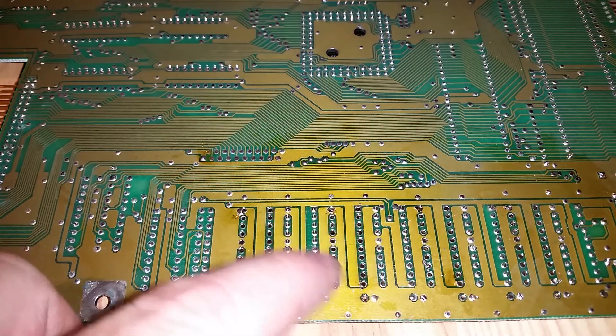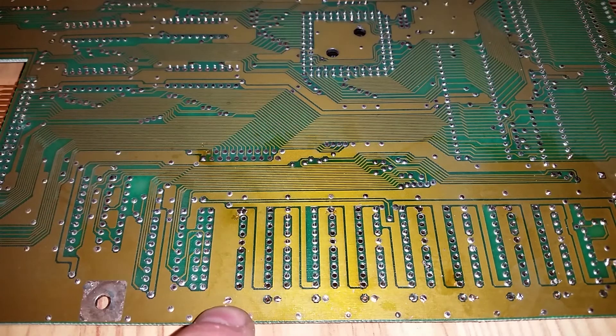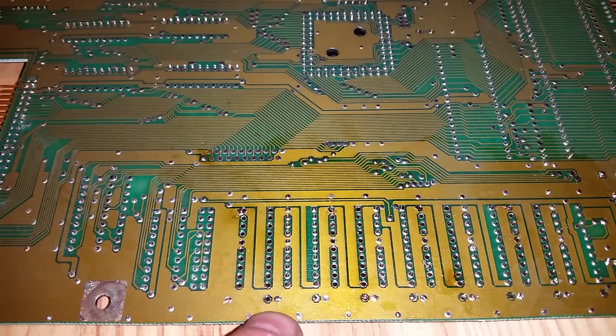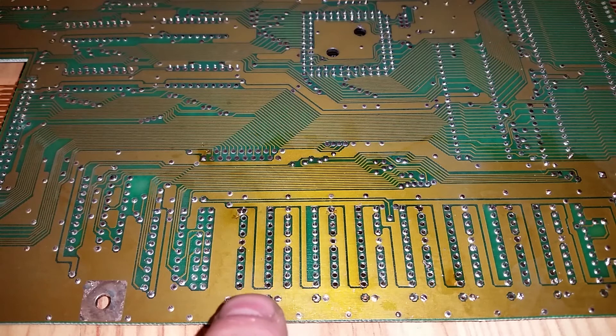The only issue is on these bypass capacitors - one hole is no problem to solder suck, but the other is straight onto the ground plane and takes a lot of heat to clear, and I haven't managed to do that. I'll try it without those bypass capacitors for these particular chips, because it's got other capacitors for the other chips very close, so hopefully it should be okay. If there is an issue running programs I'll come back and use a hotter soldering iron to desolder those holes.